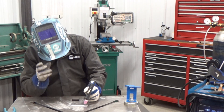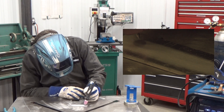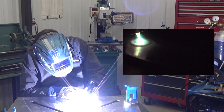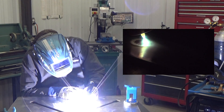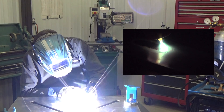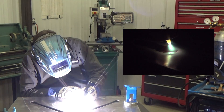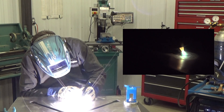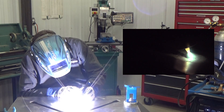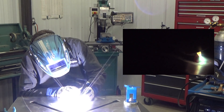We're not even adding filler metal yet. Use that same 1/8 inch aluminum — start the arc, get the puddle started, then widen it out to the proper width, and then just move it down the piece. If I get too hot or I don't move fast enough, the puddle gets real wide and it washes out. Or if I move too fast or don't have enough current control, then I lose the puddle. What I'm looking for is that nice consistent weld puddle.